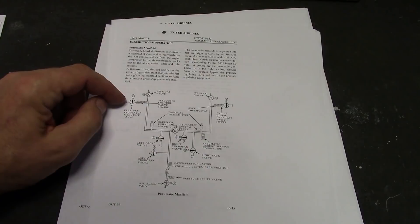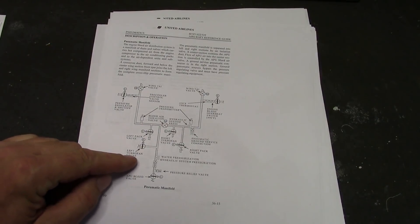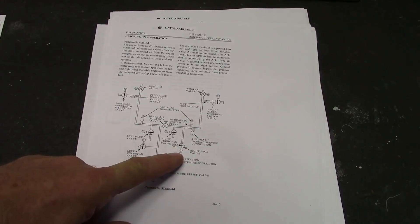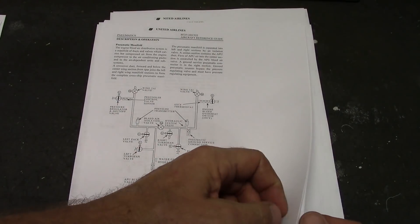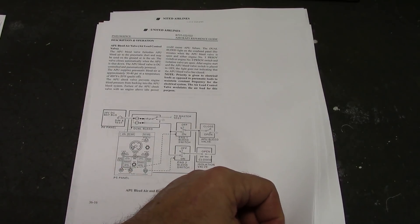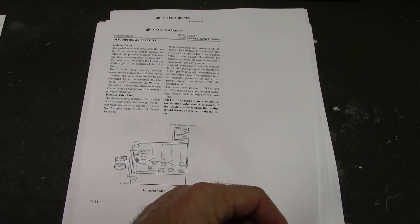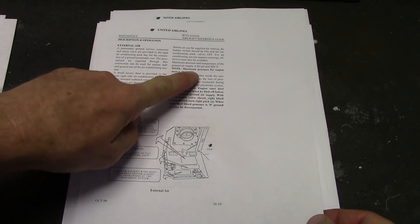Here's a block diagram the printer didn't quite make big enough. We've got the pre-cooler valve — this allows air to go through a really cool intercooler, great for a large piston engine. The fan has low pressure air at basically ambient temperature and two or three PSI. Fifth stage bleed air: at idle, 7 to 8 PSI, 183 degrees Fahrenheit — insufficient. Take-off: 116 PSI, 666°F — adequate pressure, way too hot. Cruise: 101 PSI, 600°F — adequate pressure, way too hot. There's the fifth stage check valve, the thing that's giving us the problems.